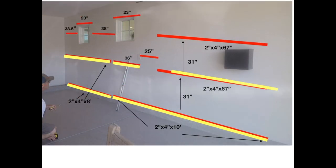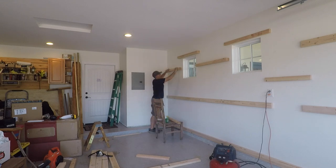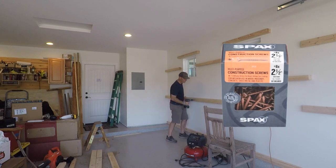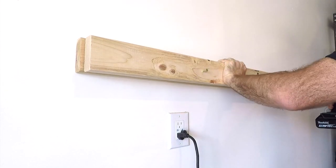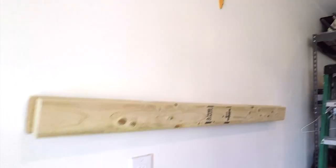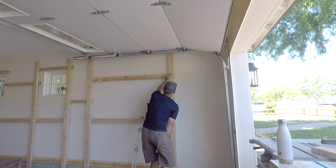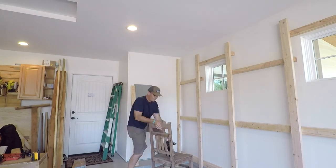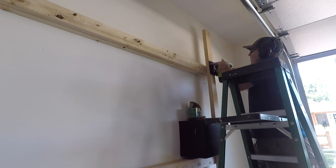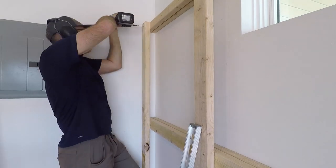Here's a quick illustration: all the red bars are what's already up and the yellow bars are what I'm adding. When I cut all this wood, I made two copies of everything, so it goes really quick. I'm using two-and-a-half-inch screws, screwing the second board on top of the wall board — not all the way, just to hold it temporarily. Then I put in the vertical pieces — a full two-by-four by eight — and go back and saw them off. On one end I had to remove the board, cut it, and put it back up.